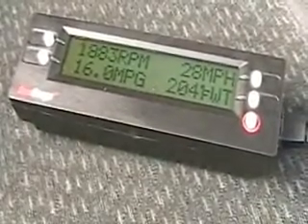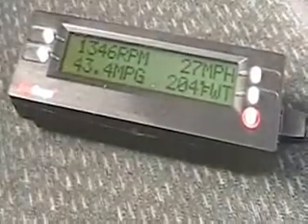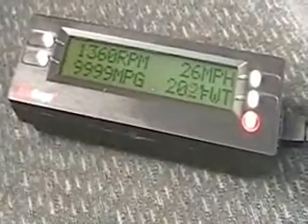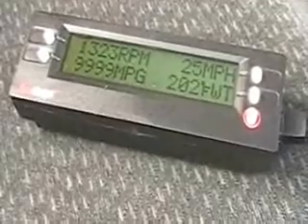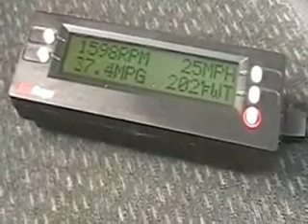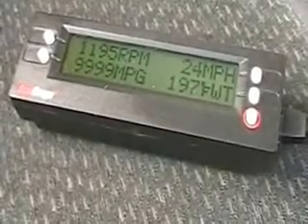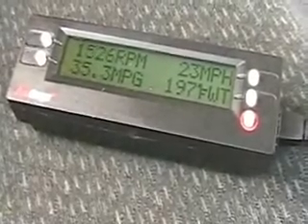The focus cell has 11 plates and there's a neutral plate between each plate. So you have 3 positives, 3 negatives, and then there's a neutral plate between each one. They're spaced about 1 and 1/8 of an inch apart, including the neutral plates. So you have positive space, neutral space, negative space, neutral space, and so on. So there are 11 plates.